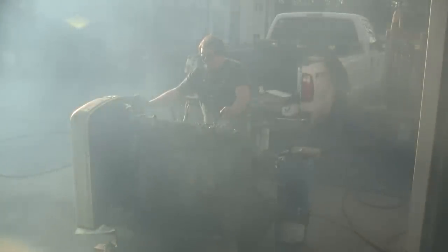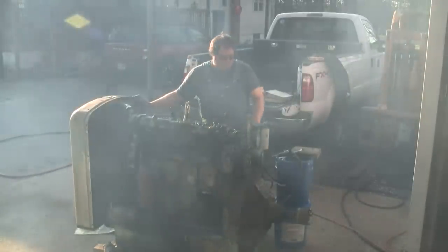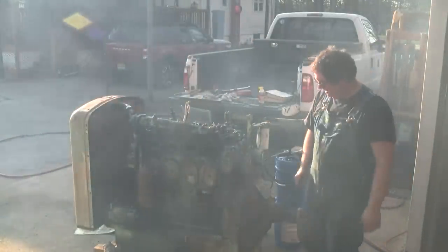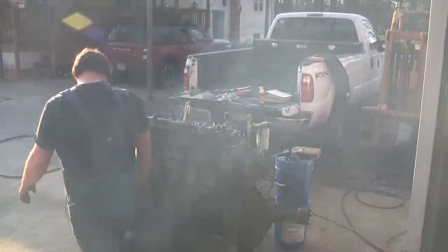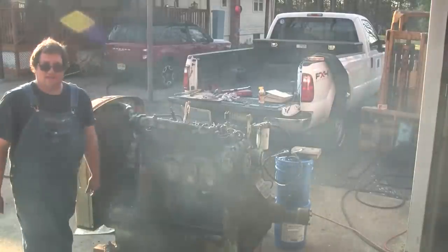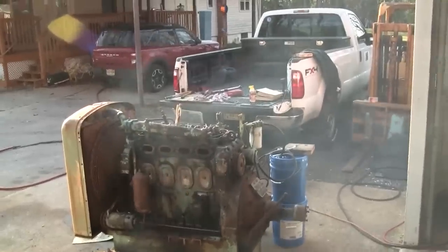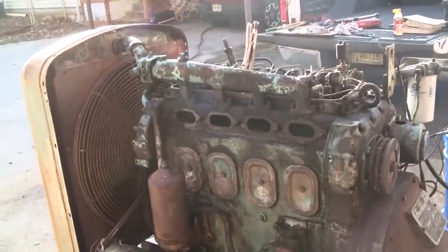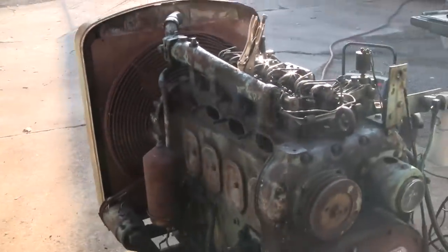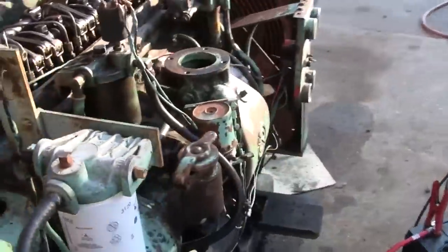All right, I think that's enough with no exhaust on it. We do have some neighbors over there, and it is Sunday afternoon. So we had about 40 pounds of oil pressure at moderate throttle. Of course, the oil is still dead cold. We didn't really put any heat into it yet. Just a tiny bit of heat, nothing really. Well, it's not completely dead after all, is it? I mean, it needs completely rebuilt. Who are you kidding?